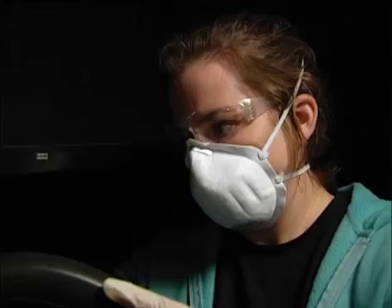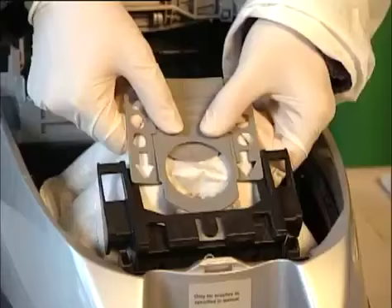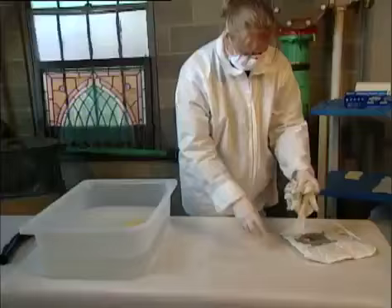The same careful approach goes for other objects. Leave the object in place and vacuum without touching it. If you're going to vacuum a book in a bookcase, keep the pages shut — if you open the pages, the soot and ash can fall down in between the sheets. Make sure you vacuum everything just the way it is in the affected area. Replace vacuum bags often and wash the attachments frequently.